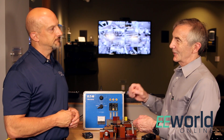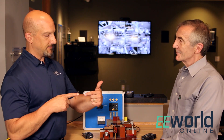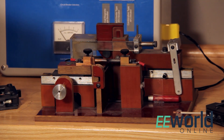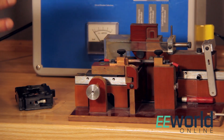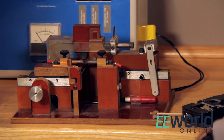So Dan, are all arc fault detectors also ground fault detectors? No, that's the difference here — that's what makes this one dual purpose. There was an evolution of arc fault circuit interrupters: they went from detecting a series arc, where two ends of one wire come together as if you nicked a wire, to also detecting a parallel arc, where two separate lines accidentally contact. Then there's also ground faults. The dual purpose unit covers all three of those combinations.